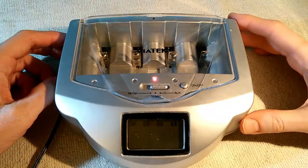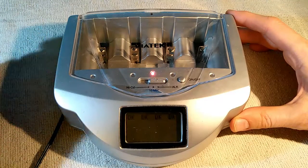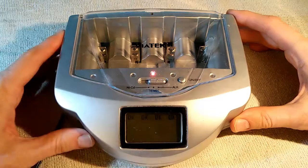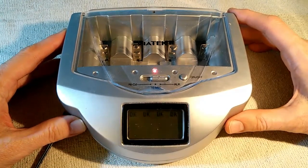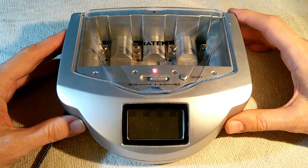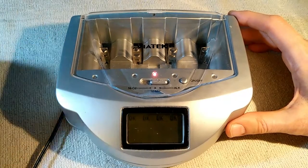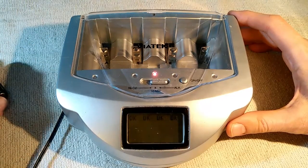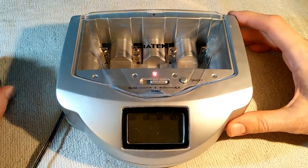I tried it on several alkaline batteries and what I found was that yes, indeed, you can put some charge back on them. It depends greatly on the level of charge that you're starting at. If the battery doesn't go below say 1.2 volts or maybe 1.1 volts, you can recharge it back up to 1.5 volts. The question is how much energy are you actually putting into that battery. The lower the voltage you're starting with, the worse the result. If you're starting at below 0.7 volts, it's kind of hopeless — you really can't recharge them.